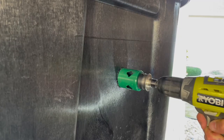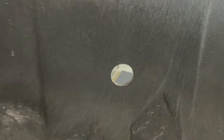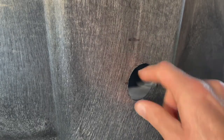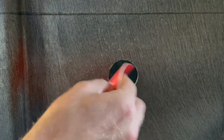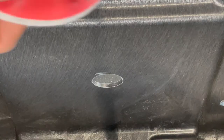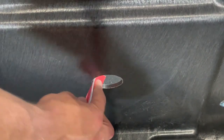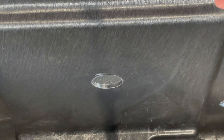And there we go — we've popped through. This is what that hole will look like after this step. Nice and clean on the inside. We'll clean up some of that burring after the fact. To clean this up, go in with your hand first to remove as much as you can. Some of that stuff will be stuck, so grab a little sandpaper and take that edge off. On the inside, go around the edge but make sure you're keeping it angled so it's literally just the corner of that hole. And there we're basically done.